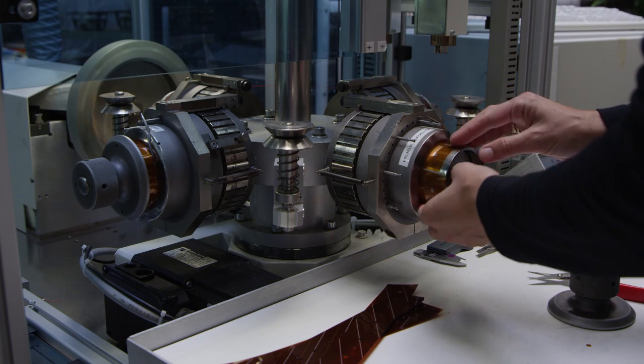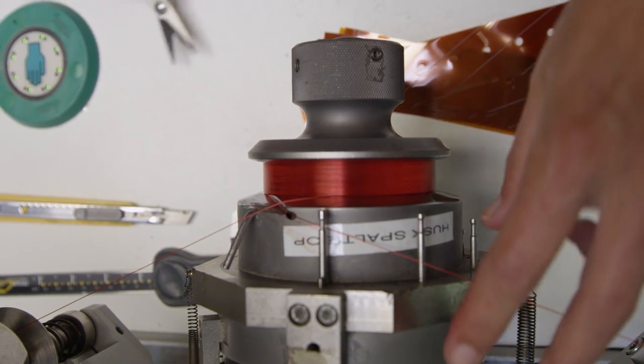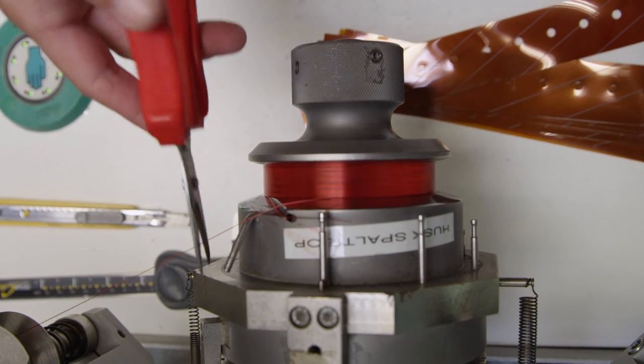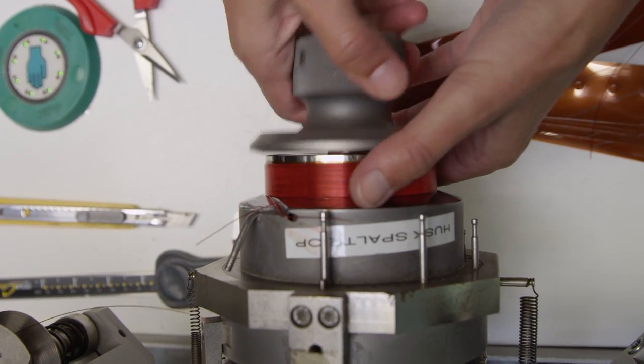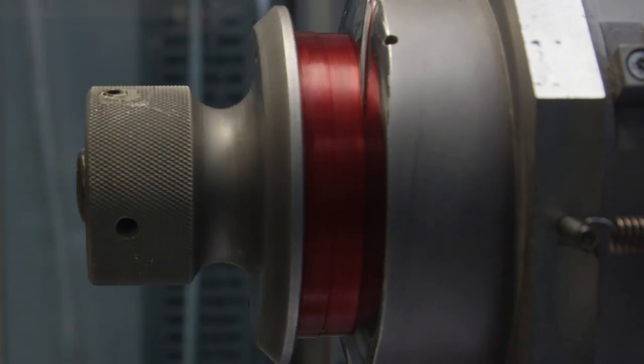When we have the motor system we design the voice coil. We use aluminum wire, which is light and kind of brittle, so it requires expertise to handle. The benefit of using aluminum wire is the reduced weight — we can add more windings and hence get higher force in the driver.